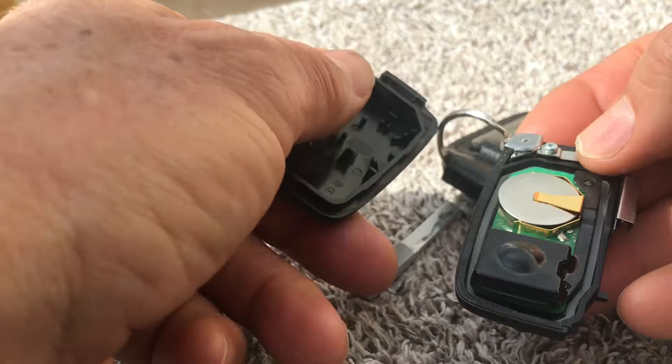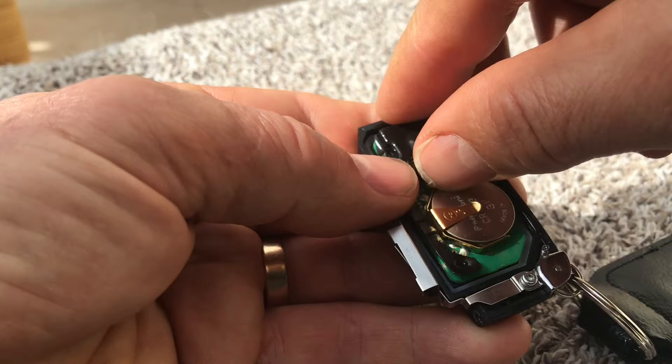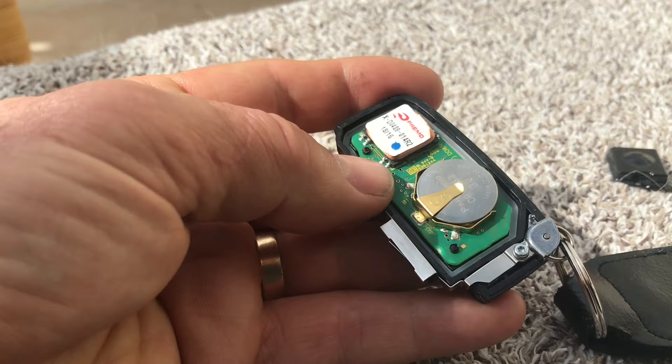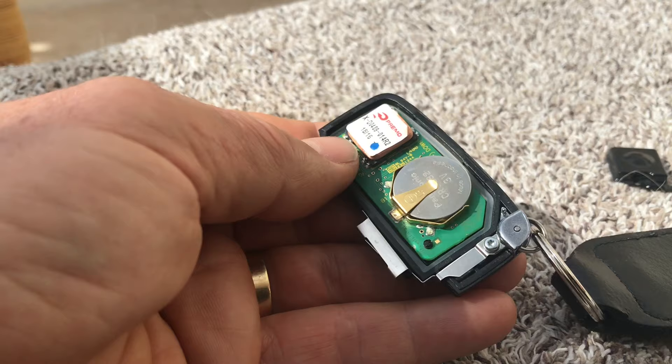Here is the insides of the unit. When I first looked at it, it didn't look too bad, not a huge amount of water in it. This cover will prise off, it's held on by a couple of bits of melted plastic. It does actually have a water seal in here — this little rubber ring around the edge — which does do a fair degree of water sealing, but through a whole wash cycle, hot and spinning, a little bit of water obviously got into the unit.